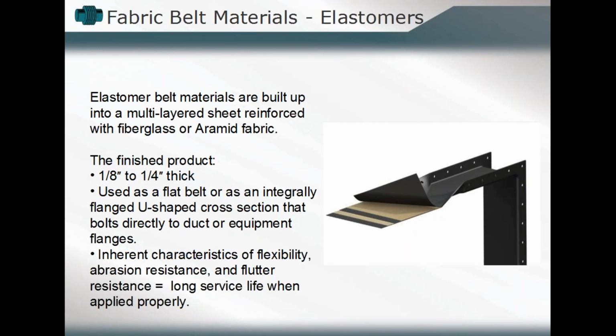Okay. Now, the elastomer belts, what we call the rubber belts, are essentially built up of multiple layers of sheet, reinforced a lot of times with fiberglass or an aramid fabric. In the majority of cases, what you're starting with is a 1/8 of an inch single layer component. It can be built up as requirements dictate for the entire design. It's used primarily as a flat belt, or it can be integrally flanged in a U-shaped cross-section that bolts directly to the duct or the equipment.